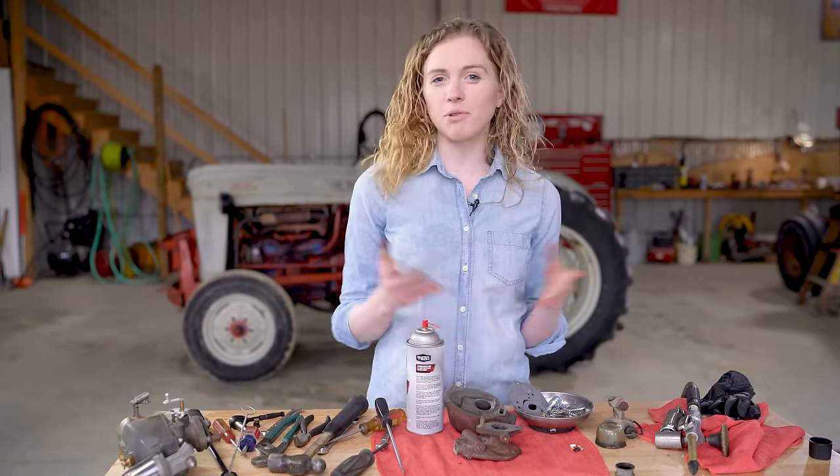Your choke shaft has a little spring like this. These springs get broken all the time. If you want a new one, you need to purchase at least a complete kit. Also, the comprehensive kit, of course, will have it in it. You put the round part over the round peg. That's easy. Then once you slide this in, you catch the square tab onto the end of your shaft here, and then you pull it out just enough so that you can bring it over the peg, and then you push it in so it rests like that, okay? That's difficult for some people to get that orientation right. Hopefully that video will help you get your spring in the correct configuration.